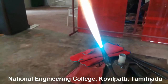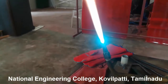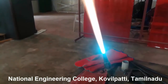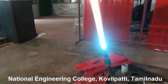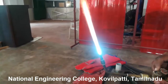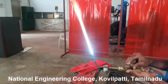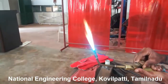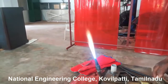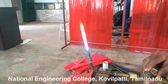Neutral flame has an oxygen to acetylene proportion of 1:1, and is used for welding steel, stainless steel, cast iron, copper, etc. Carburizing flame has an acetylene to oxygen ratio of 1:0.9 and is used for welding steel and aluminum. Oxidizing flame has an acetylene to oxygen proportion of 1:1.2 and is used for welding copper, brass, and bronze.